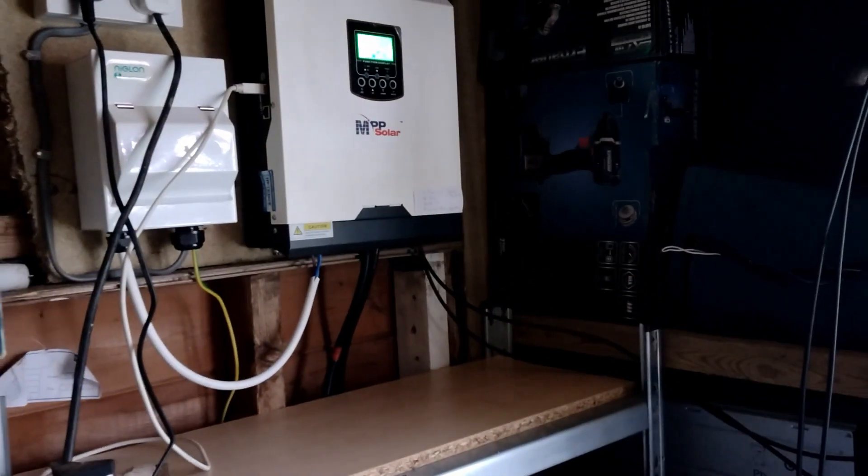This is an older video. What I did was build a battery box and I wanted to measure its capacity. Measuring capacity has to be accurate - without that you're going to get problems. As you'll see in the video, the inverter itself has a completely different calculation. It takes off its own power consumption, which is about 16 watts - though it can go down to about six watts.